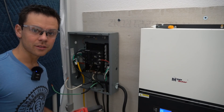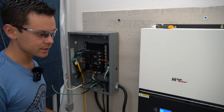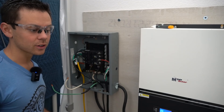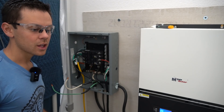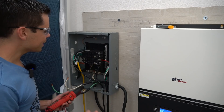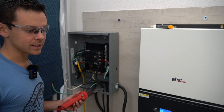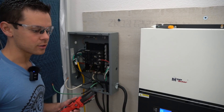Last night, Filter Guy and some other forum members were discussing the ground-neutral bond in these all-in-one systems. They said that when the inverter is on and powered by battery, there's a ground-neutral bond — and I did not think that to be true. That's why I created my own in the panel, which would allow me to charge my Tesla because it needs that ground-neutral bond.